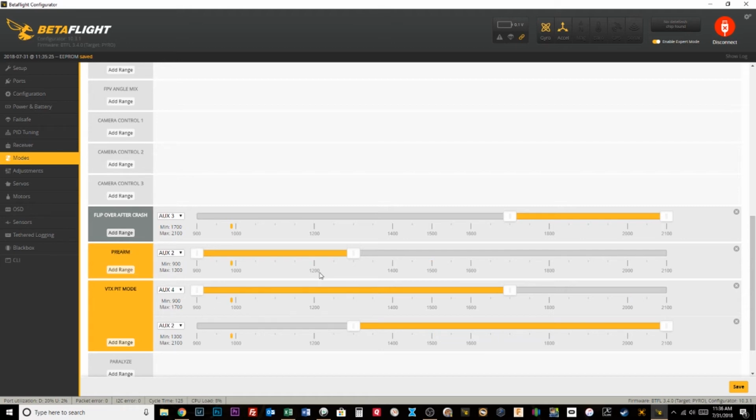The other thing, if I put my VTX switch off, I want to make sure that all VTXs are off regardless of my pre-arm switch. And this is primarily because of team racing. I want to make sure that when I plug my quad in, waiting for the next guy, it is in VTX pit mode. That's the way that works.